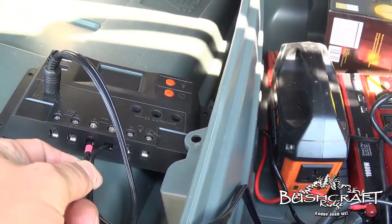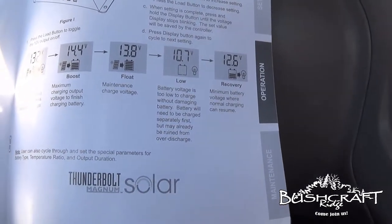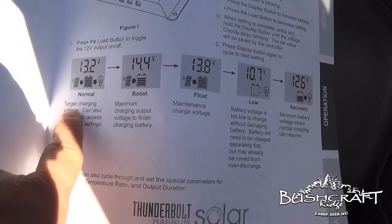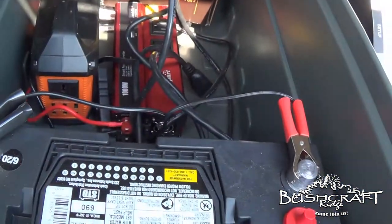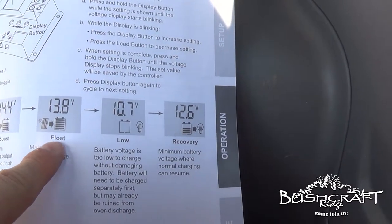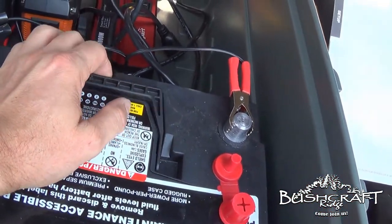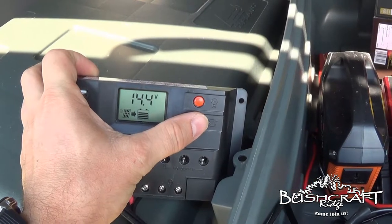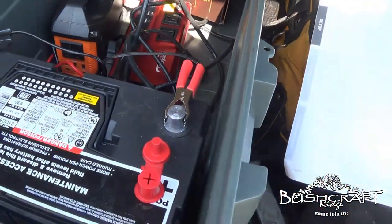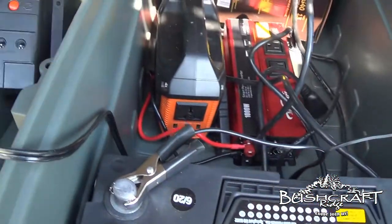Here are the wires that are hardwired into the battery charger. On the normal setting you get it to the target charging voltage, and now that it's charged to 13.6 and the indicator isn't blinking anymore, I'm going to switch it to float, which is the maintenance charging voltage. So it's fully charged after a few hours in the sun, and now we'll cycle over to float. That's where it would stay if I just left it on the charger. If it were actually in use, we'd go back to normal.